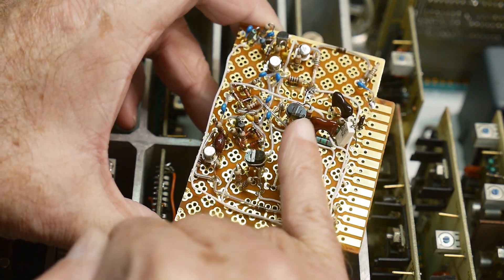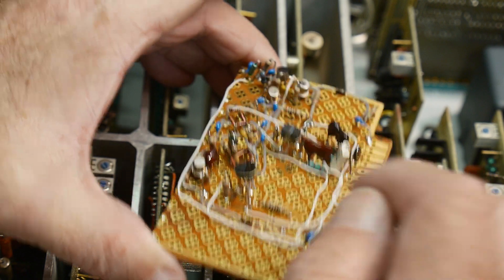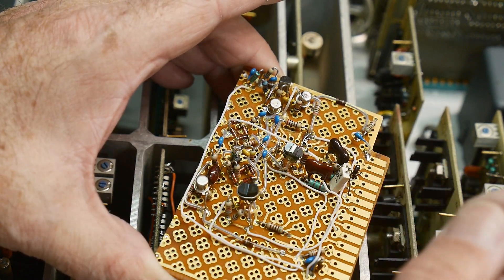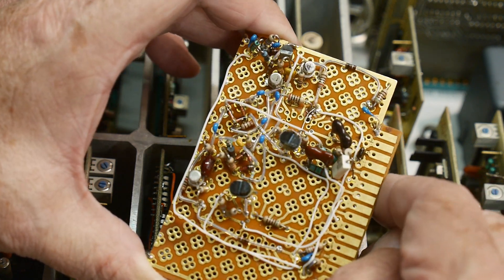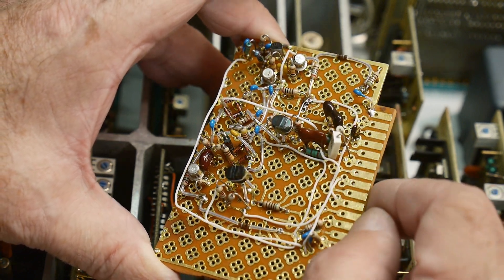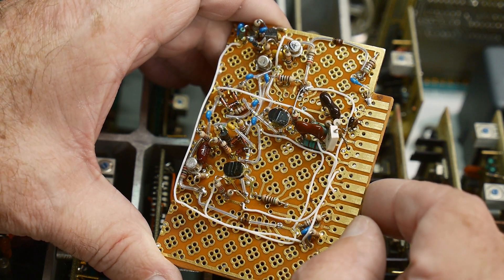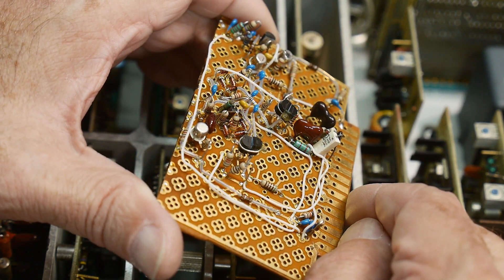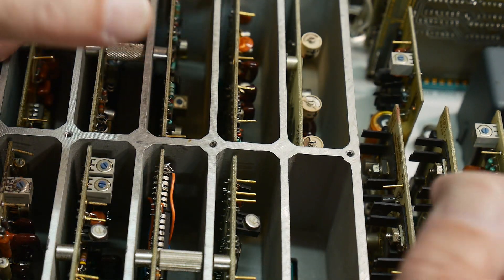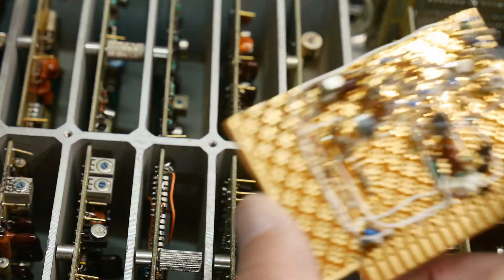What they've done here is taken some transistors or FETs and glued them together back-to-back with a little one-turn winding around them to hold them together — so these are thermally coupled. There's a diode bridge here and a diode bridge here, which are probably mixers of some type. HP hands have definitely been on this.